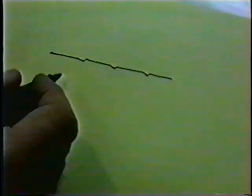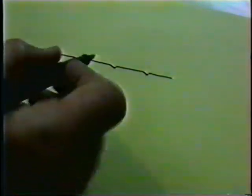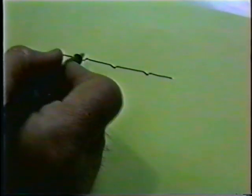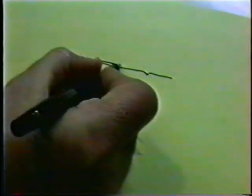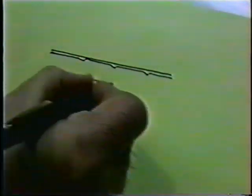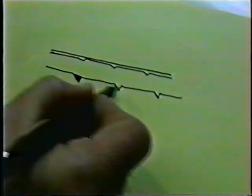Now, because this is the advanced video, we can talk about a couple of tricks that I've tried. And one is, I've tried to take the raw wood surfaces, and let's just make that this is the grain. These are things that I've found haven't worked well. I've taken DAP, added a little bit of water to it, and troweled on a layer of DAP so you almost couldn't see the wood, and then sanded it down so that in the grain of the wood I had this. I just had DAP in the grain.